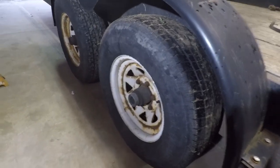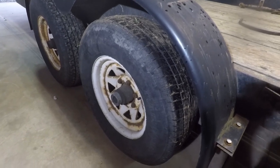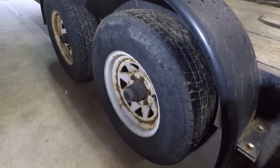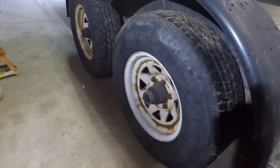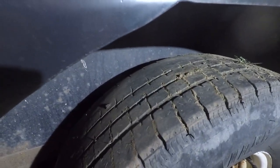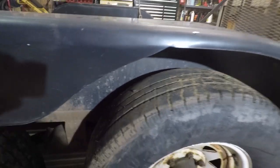You know, when I bought the Mini, I towed it, I don't know the mileage exactly, it was about 3 hours, and no issues there either. And I inspected the tires, and it's got the Easy Lube axles, so I greased everything up. Everything's been working good, but you can also sort of tell here that the inside of the tread is completely bald. So I'm definitely having some kind of issue here.